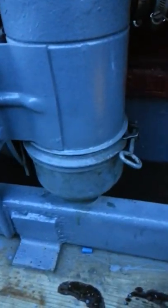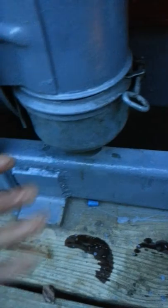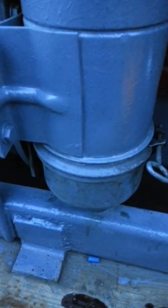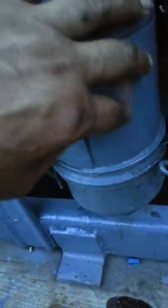And that's how you change out an oil bath. You untie it here, it comes out, you have the whole cup. You dump it out, clean it — you can wash it if you want, or just clean it with a rag. After that, fill it up with oil to the oil line, making sure the bottom of the cup also fills up, not just the circle on top. Inside you have a mesh — it's made out of like a brillo pad.